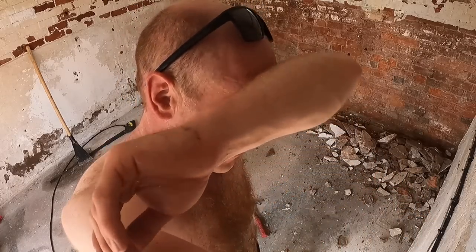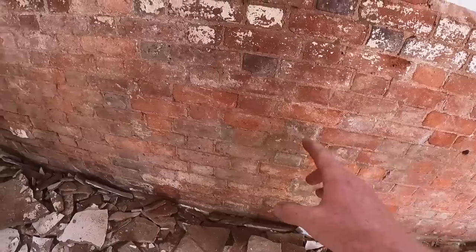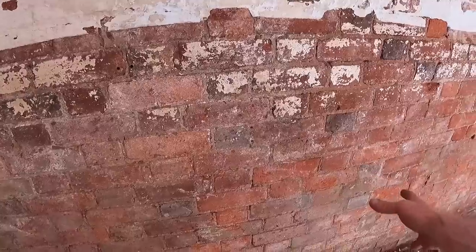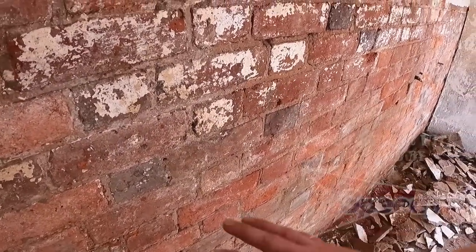Apologies about the work there — that wall deserved that. All the lime marks are preserved behind there. The restoration couple in me is coming out now. I feel like we really should be breaking off all this cement around here, getting it back to a nice breathable building. But that wasn't the plan. If I go ahead and paint all this, then at some point it's all going to have to be stripped or blast-cleaned off, which is fine. I think because we're going to have a doff or blast system in here at some point, if we just put a normal water-based masonry paint on there it'll probably be okay. At least the render wasn't that good — I mean it held up all right for 50 years or something, but at least it came off clean. Sometimes you see people rake out all the joints and then render — that's a nightmare to get rid of.